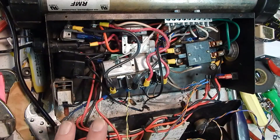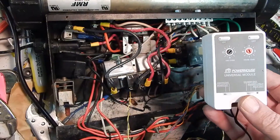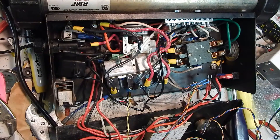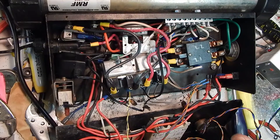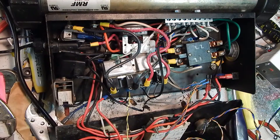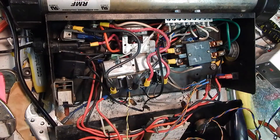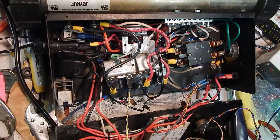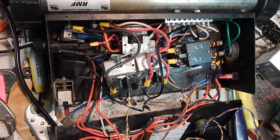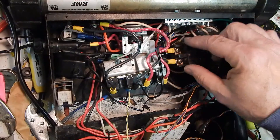Right now it's going to be a dumb project — it's just going to turn on and off. The heater is going to turn on and off with X10. But at least I'll have the power part done and I can move on to probably putting an ATtiny or an Arduino board to control it, make it a little more intelligent on how it controls the heat. Because the basic issue is you need the water to circulate long enough before you judge the temperature, and then you can accurately judge the temperature and heat or not heat. I got the relays in at an angle just to make everything fit.